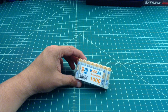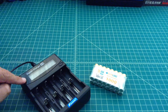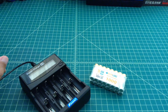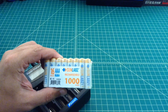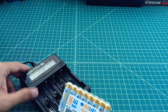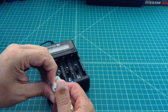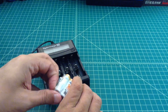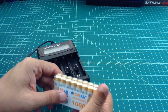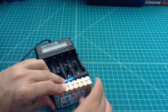What we're going to do is open this package of batteries and stick them in the Fox Novo digital charger, the 4S. We're going to top these batteries off, then drain them down and fill them back up to see what the capacity turns out to be. We'll run this test at half an amp, see what results we get, and then we may do it again at a full amp.